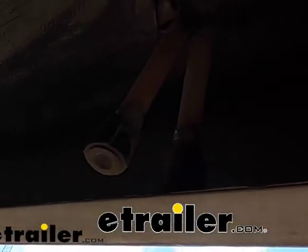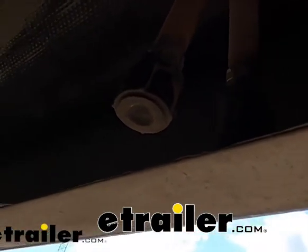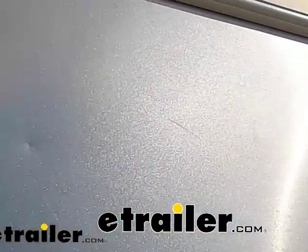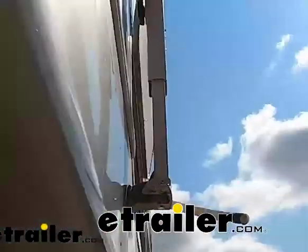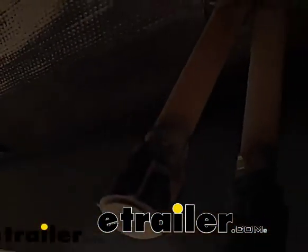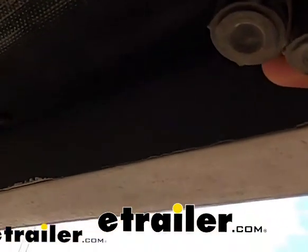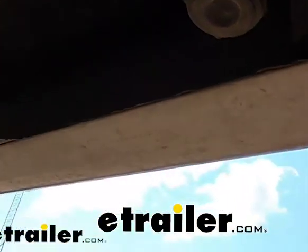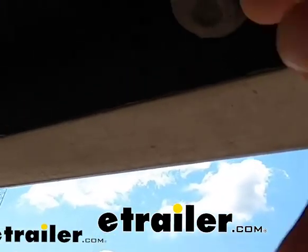Then we'll want to come underneath our camper. This is one of the last steps that you're going to do. Our access point is right up there. You can see our hose sticking out still. So typically right underneath where the water pump's at, we have 2 low point hoses here. What this is going to do is drain out any residual water from here to the pump itself and from our city water connection.